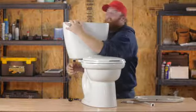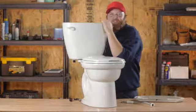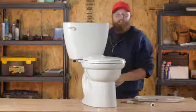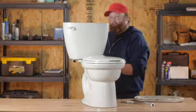Now you'll grab onto the side of the tank and press down and tighten up that nut a little bit more. Then you'll go and do the same thing on the other side. What you're doing is compressing that washer down so that way it has a nice seal all the way around. After you get it hand tight go ahead and take your pliers and your screwdriver and snug it up a little bit more.